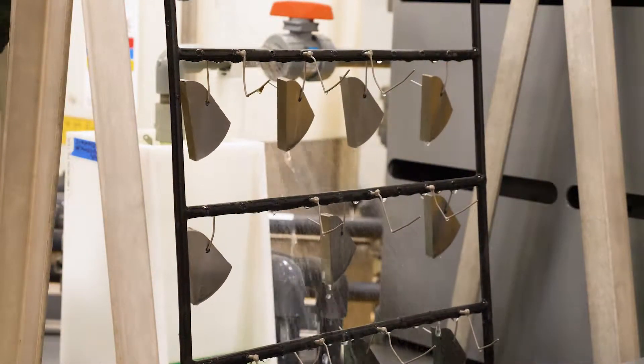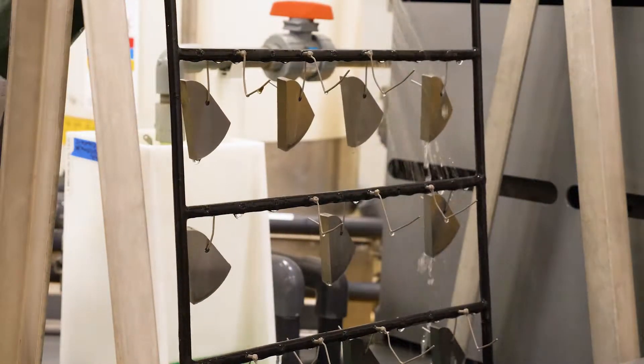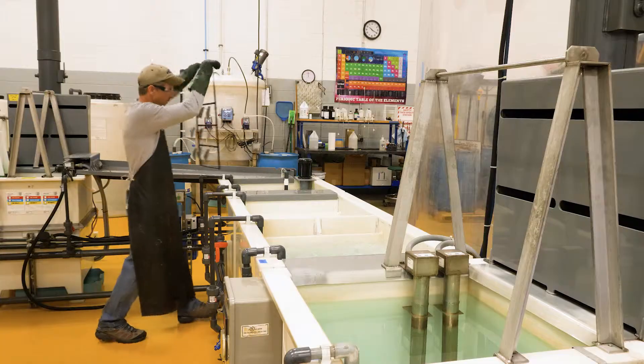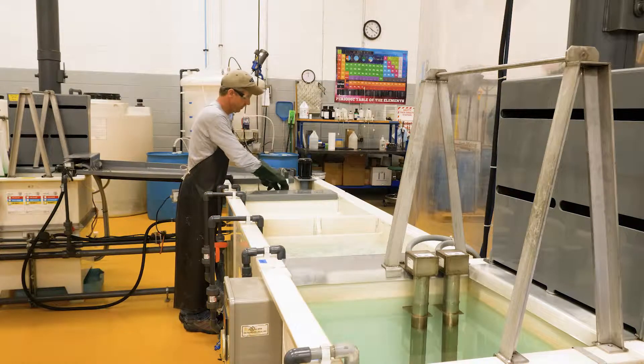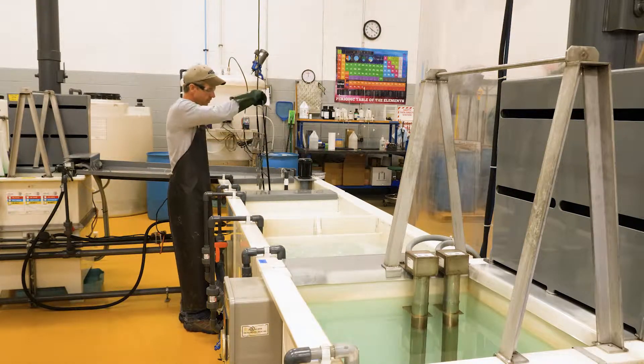The ultra-high phosphorous nickel coating is less decorative and more industrial than electroplating, and ensures your blocks will look great for years. Following the nickel tank, there are three more rinses at ambient temperature, followed by a hot rinse to help harden the plating.